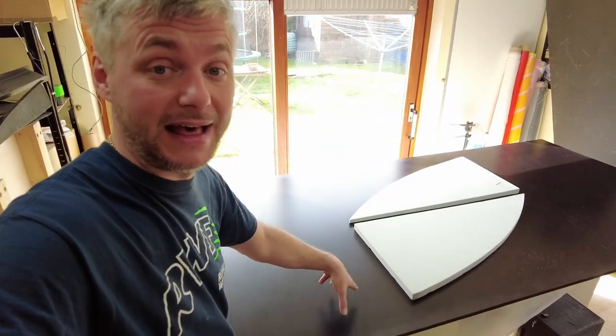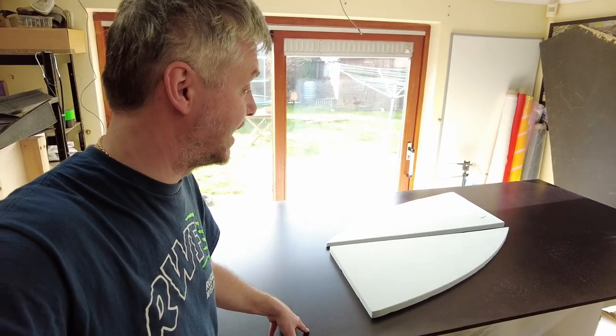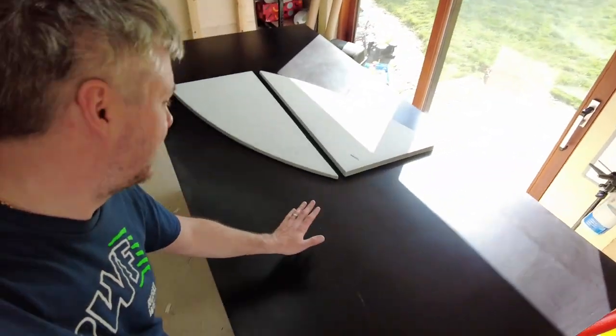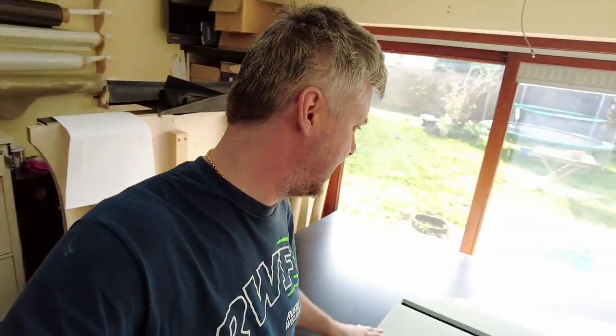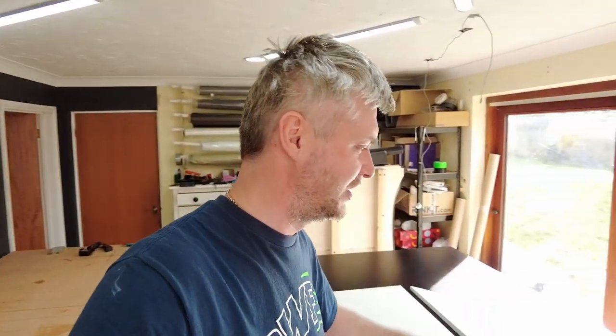All I need to do really is cover them in carbon, because most of it is going to be hidden underneath the car anyways, but we want it light and we want it dimensionally accurate. So we have those two parts. I put back my surface that I've molded this splitter from, which still needs to be finished. All I have to do is pre-cut carbon, and I think this is going to be wet lay. I might actually do a hybrid of wet lay and then one infusion, but most likely it will be wet lay. Very, very simple. Just wanted to show you guys how you can literally do it without expensive equipment. Let's go.